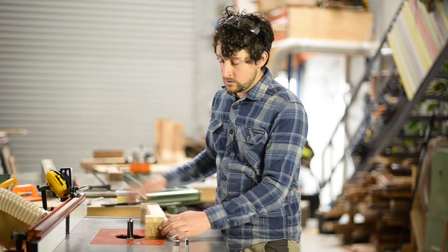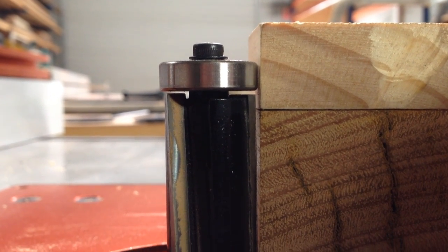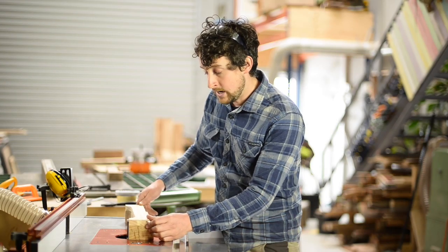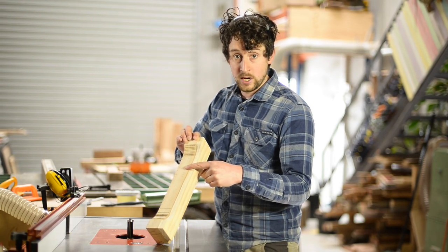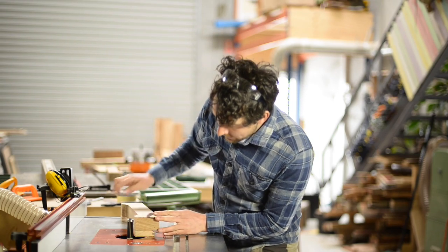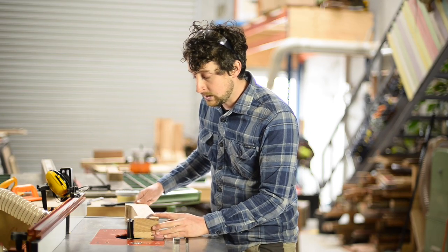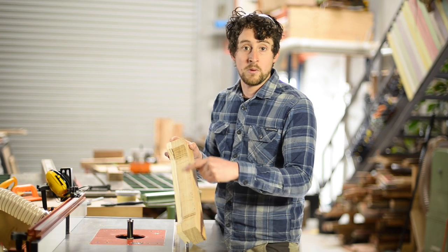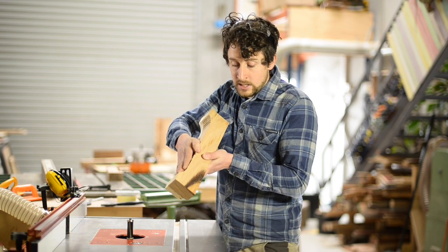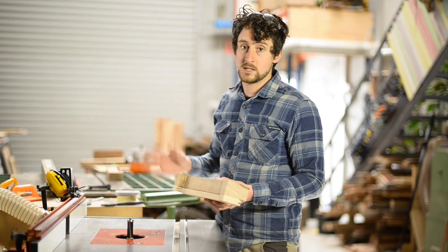The first thing to ensure is that the bearing is sitting at the height of your guide and that all of the bottom piece of timber will come into contact with the blade and not the bearing itself. The bearing should be touching the top template; the blade should be touching the workpiece. We'll do the first pass down the hill to just past the centre, then flip it over, raise the blade so the bottom bearing is now in contact with the template, and go down the hill again to meet in the middle from the other direction. The reason for doing that is to avoid a whole bunch of tear-out as the blade would otherwise be tearing up against the grain direction - really important, as on timber like this it would just tear out all over the place.